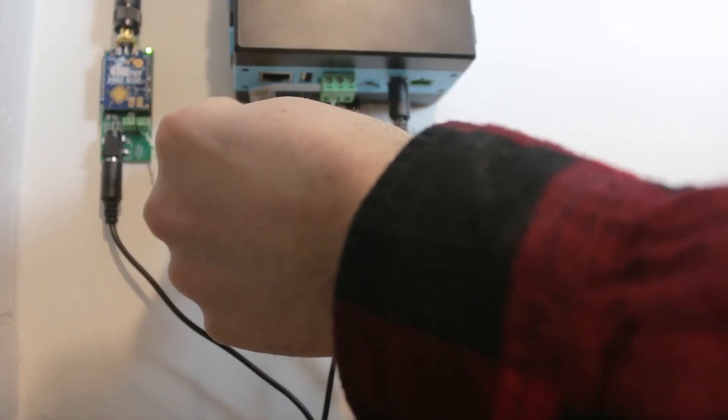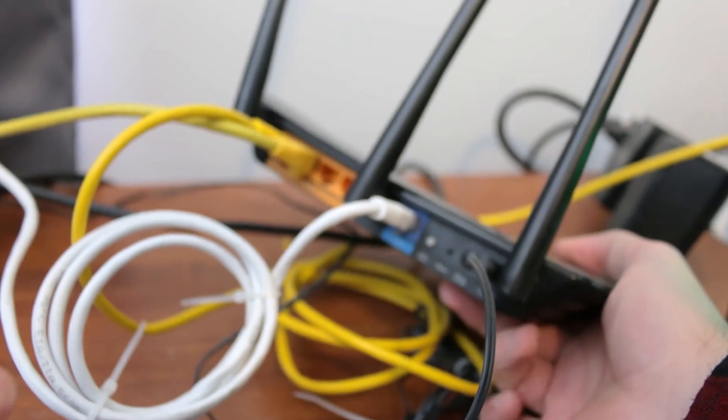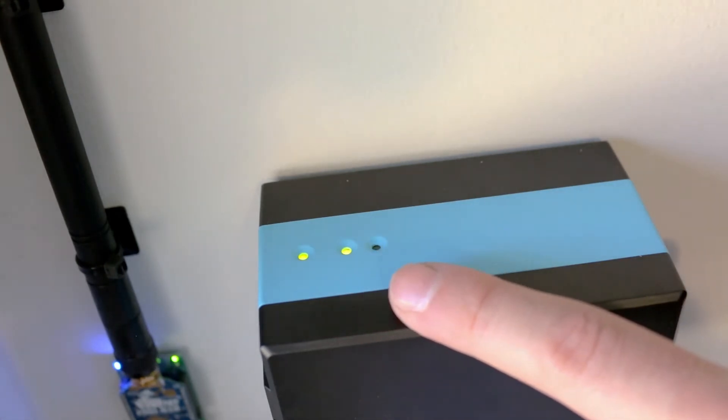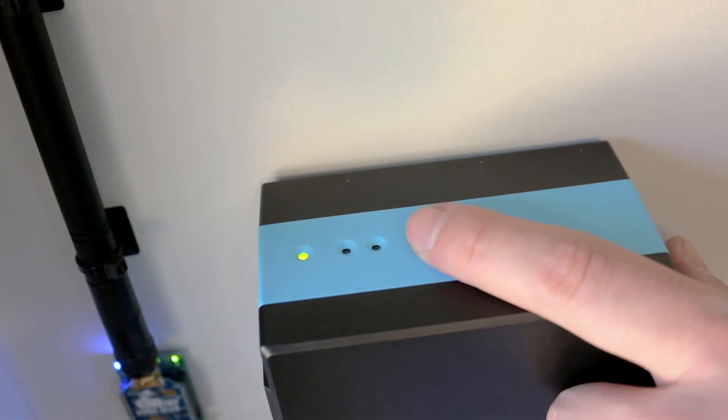For those wishing to hook up ethernet, you can do that right here — we'll plug our ethernet cable right into our router on the back so we can communicate with the cloud. Once you have all your wires set up, look up top on your Push 3 — you have three LED indicators. The first one over here will be solid green, indicating your Push 3 is powered up. The middle one is your internet indicator and blinks green every time a meter read is pushed to the cloud — you'll want to see this blinking on and off. The one on the right blinks more readily, meaning it is reading from your Omnimeter and is set to read as fast as possible by default, so it will blink pretty fast.